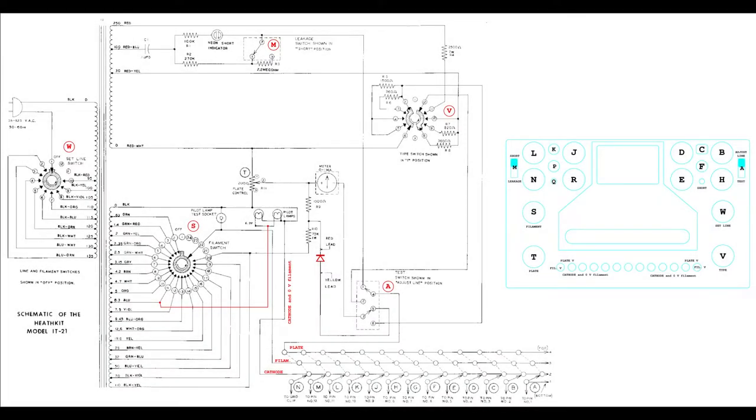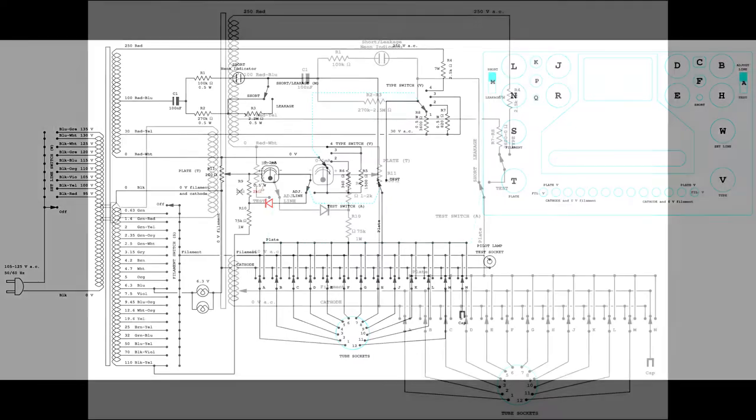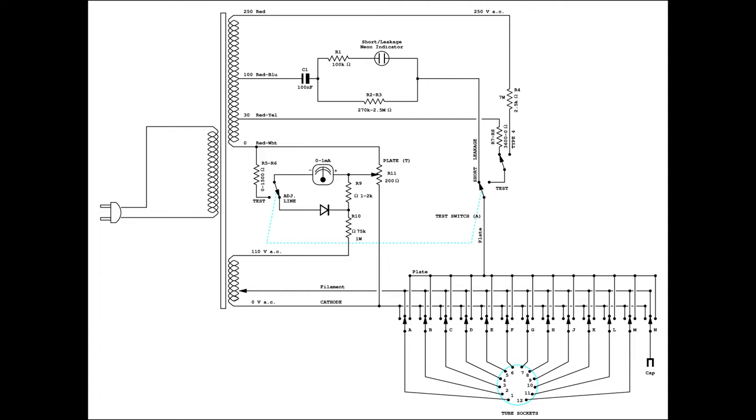The picture shows the original tube tester schematics, with corrections and addition written in red color. In the original documentation, most of the components appearing on the front panel are labeled with letters, as the picture shows. They also appear on this modified schematic diagram. This picture shows a rewritten schematic diagram, where it also appears the suggestion for a different value for R9. Finally, a more simplified schematic diagram could help to identify more easily the different functions of the tube tester.